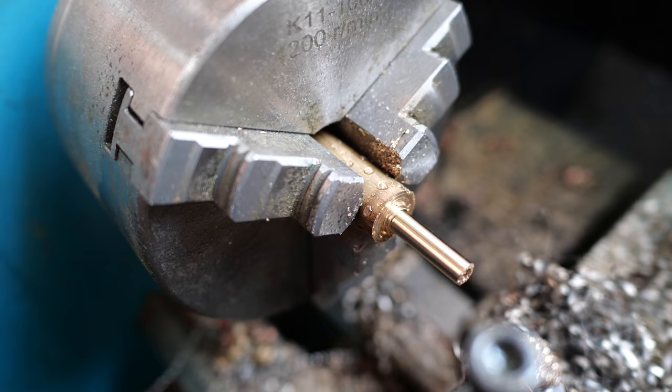With the mechanisms now working smoothly, I turned my attention to flattening the sole. It's important to note here, when pressure from the lever cap is applied, it distorts the sole ever so slightly. So it was important to flatten the sole with the frog, blade, and lever cap in situ to ensure this distortion was accounted for.